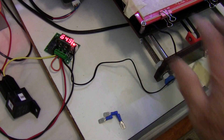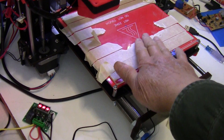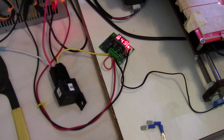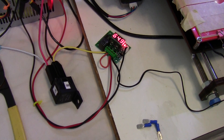For PLA I found out I don't really have to use the heat bed much — I can probably set it to 30 or 40 degrees centigrade if needed. But for ABS it seems to work better when it is at 100 degrees.